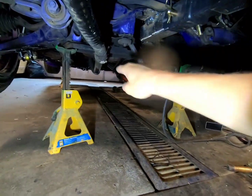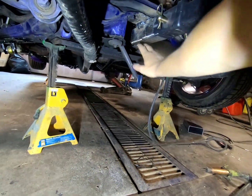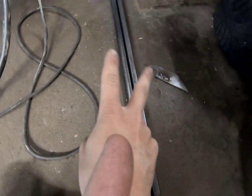So I just want a straight shot there, so all the stress goes to the hitch and not through the body. It'll have these two frames, these little guys, just all the way up to the front. Two individual ones, one in a V from the hitch. So say the hitch is here at the bottom of the V, I'm gonna shoot them up to each corner in the subframe so it can't do one of these. So when the front wheels go, it pulls on the hitch, right?